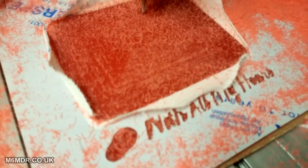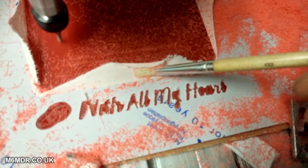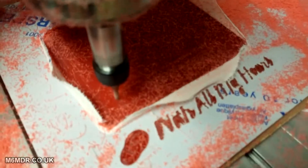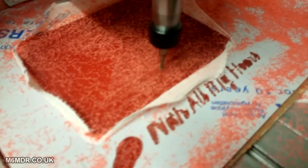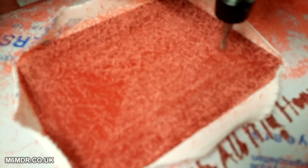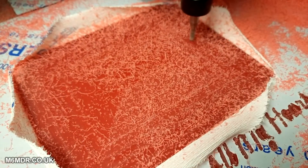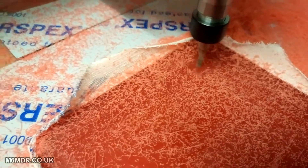You can't really see — get a brush, see if that's better. What I've found out is much slower spindle speeds is the key to acrylic. Yeah, look at all these nice fluffy little shavings through the visible area around the spindle. That's all you do — it's not melting on or anything.